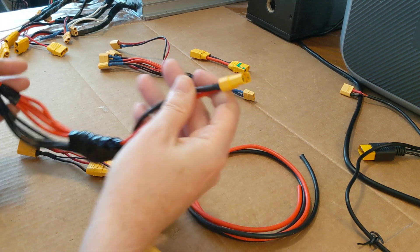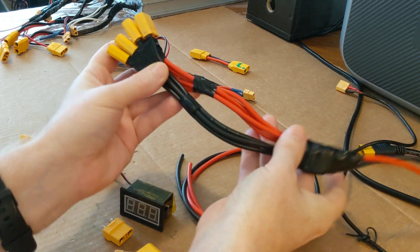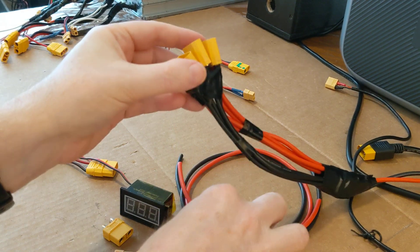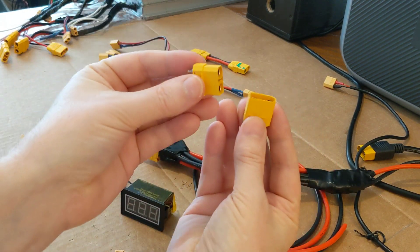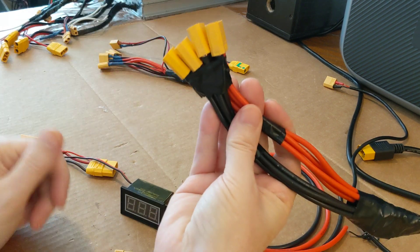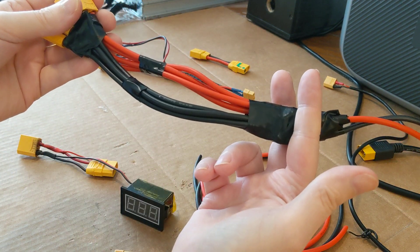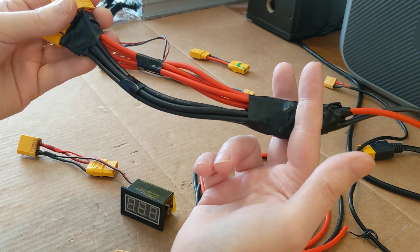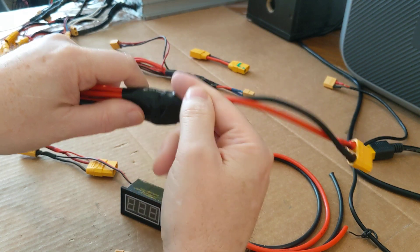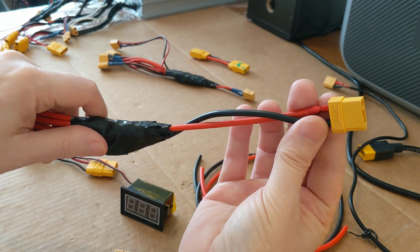I get a lot of questions about how are you combining or paralleling your four batteries. I just made a pigtail — I just took some XT90 connectors. Of course you have to have the right end because they have two different ones: one that goes in and one that goes outside. So you just have to make sure however you've wired it up that it's the same. I just soldered up a bunch of those. In this case I made them too long but I probably could have shortened that in half. At the end I bared the wires about two inches, twisted them all together and then soldered them and then wrapped them up with some tape. Same thing going out the back end but I've got the opposite plug on there.